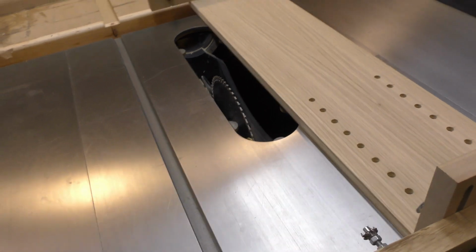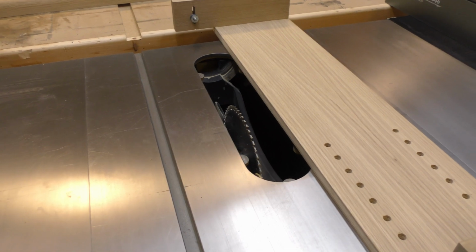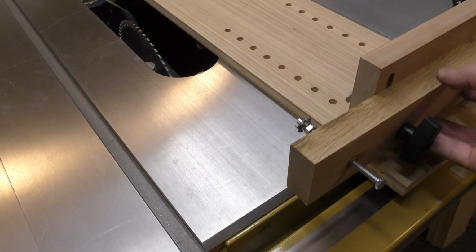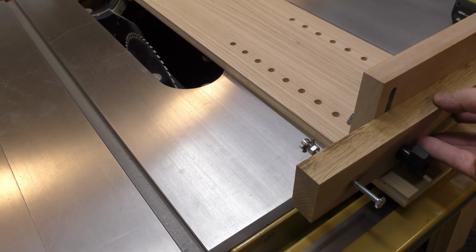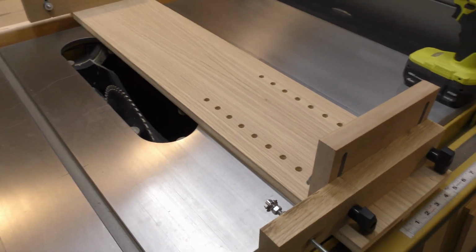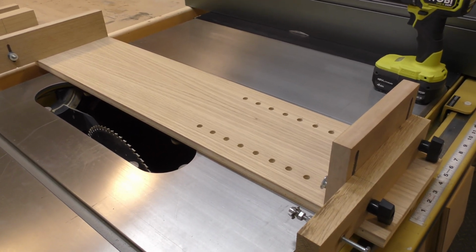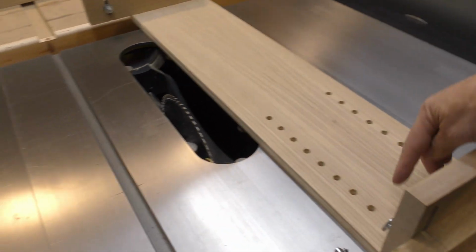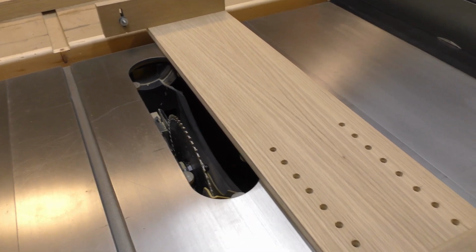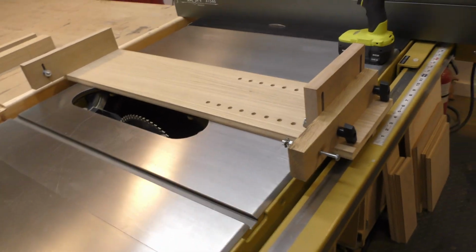And this jig can make both straight round tapers and conical ones. So to do the conical, which is what we're doing in this case, it has an adjustable back, and I can lower and raise one end of the leg and the other end of the leg as well. And that is what gives me the angle or offset to create the conical taper. I also have multiple positions in this jig so that for different length legs I can change it, as I need to.